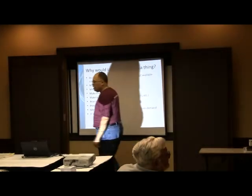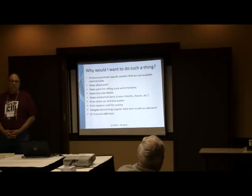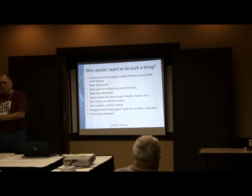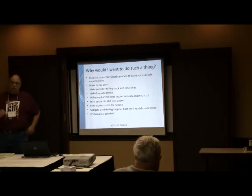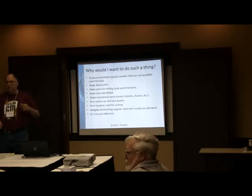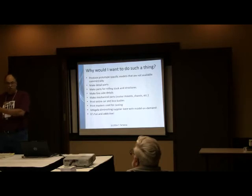Do you use the same alloy for all of your work? I used what Shapeways calls white strong and flexible plastic. It's a selectively laser sintered nylon material, and that's because it's inexpensive and strong. The detail level isn't the highest, but in O scale it's pretty useful. There are other processes, and when you're thinking about doing a model, you also have to think about what process I am going to print it in, because that process will dictate the smallest feature you can put on the model, the thinnest wall section, and the strength of the model. So as you're thinking, I want an O-scale whistle post, you have to think, okay, does it have to be strong? What's the level of detail that I need? And then you can match that to a process, and you can go on to the Shapeways website, and they will tell you the capabilities of each material and each process.